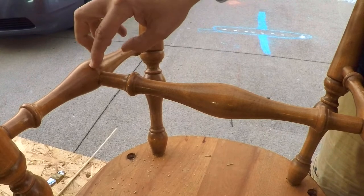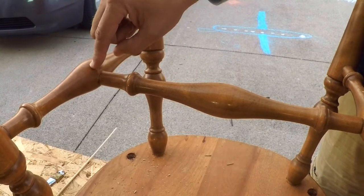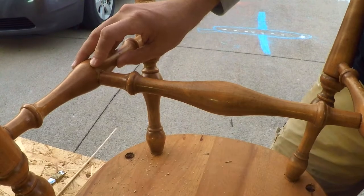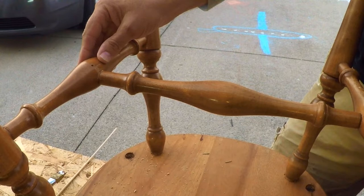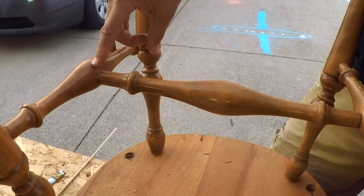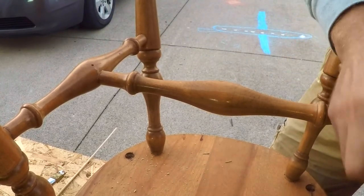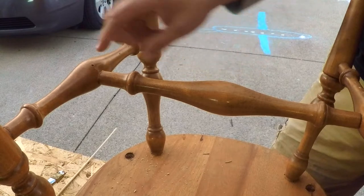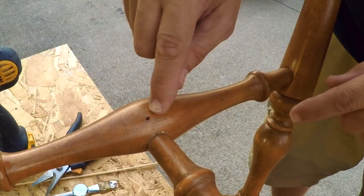So that's basically what we're doing in our chair here — putting a little wooden nail, or trunnel, through the piece that has the mortise hole in it until it intersects with the tenon that is in the mortise hole. We're going to drive that wooden nail through there. It'll go through both pieces and lock it into place. The technology itself, while simple, is very sturdy, and in our application here you can be sure it's going to be a trusty hold. Whether this is a rung, a spindle that's popped out, or a leg, this simple wooden nail will do the trick. Okay, you can see our hole there.